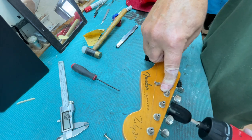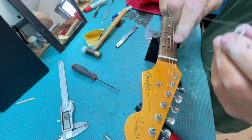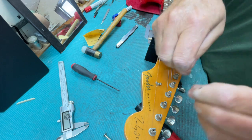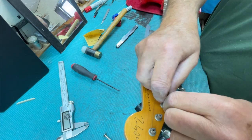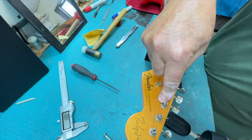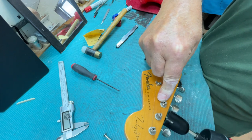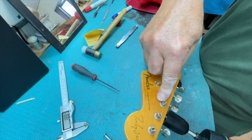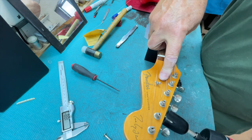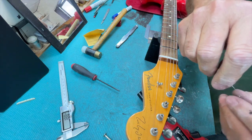And the important thing about that is that when the neck is loaded, it changes shape slightly from when it was flat on the bench. So if you level the frets with the neck flat and not under load, lying flat on the bench, you can get a level set of frets. However, that all changes when you put it under tension again, because the longitudinal forces cause the neck to curve, which is the relief, that's fine.